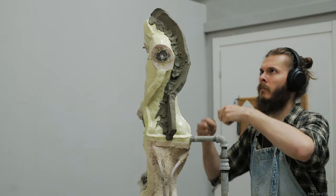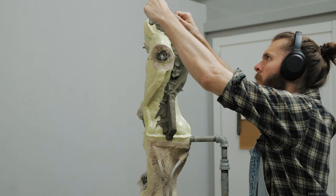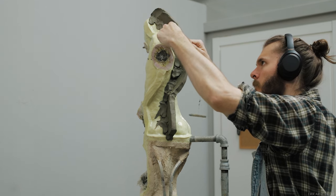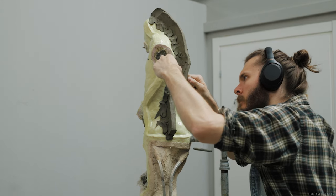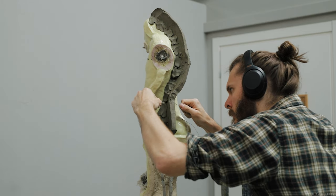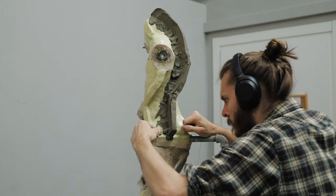Splitting a mold half into multiple mother mold pieces like this does require some experience. My best tip would be to imagine taking the mold apart when figuring out how to split the half. Imagine that each piece is going to be coming off in a particular direction and in a particular order. The order and direction actually matters quite a bit, as you'll see once we begin the molding.